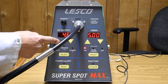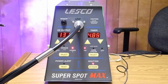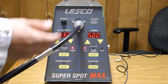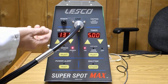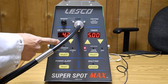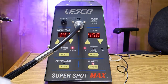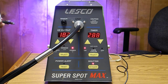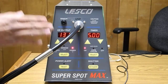If I go back to about four watts, I should have about 160-some-odd watts of electrical power. And if the bulb can no longer generate the intensity at 160 watts, the power supply will be increased automatically to boost the brightness. I'll bring it back to 4.9 watts per centimeter square and go back to the electrical power level — there you go, that's the alarm. That means this unit is driving the bulb close to the maximum edge. Whenever it hits 203 watts, the alarm will kick in and latch in for that curing cycle.